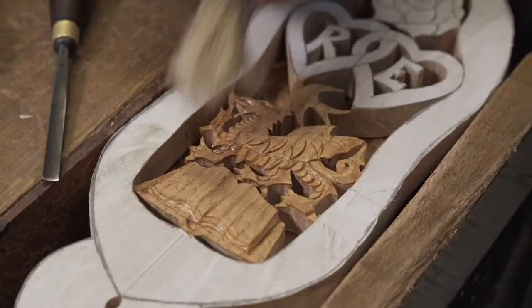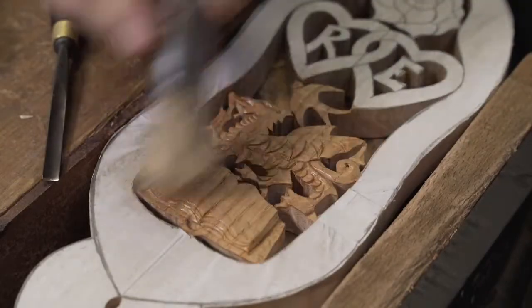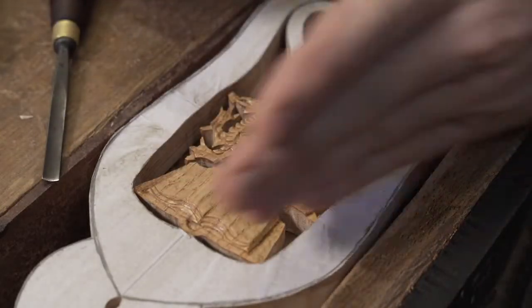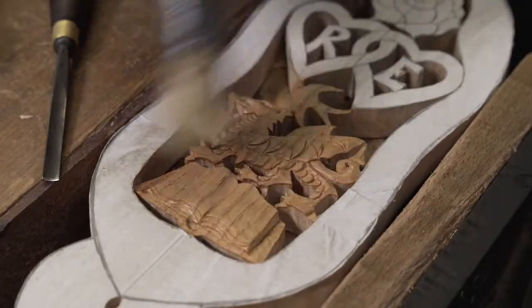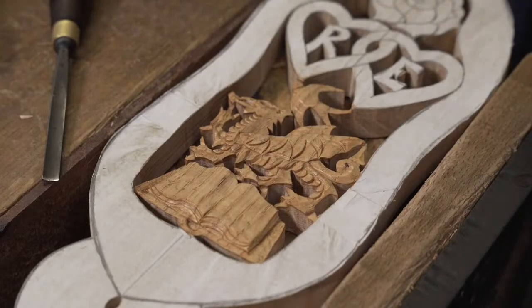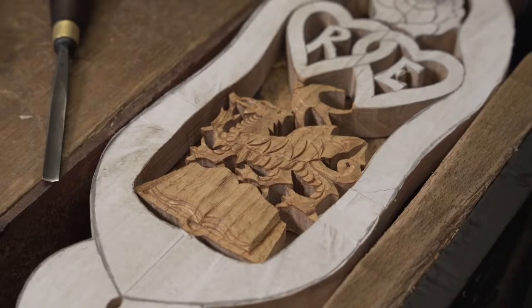And as we always say, a good wax on top if you wanted to. Yeah, you can. And as we always say, you put it on in a vertical direction. And the first coat raises the grain, so we rub it back down. Second coat on. Third coat on usually brings it up to a good finish.